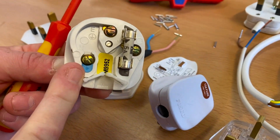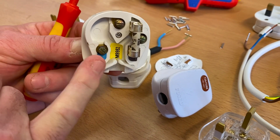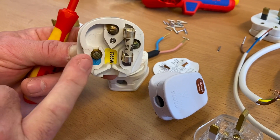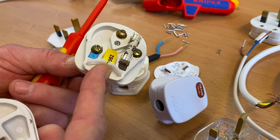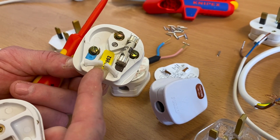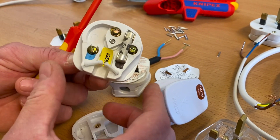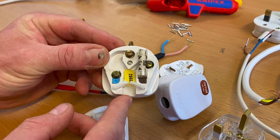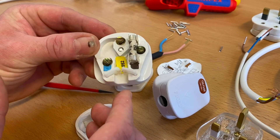Opening this MK plug, you'll see some subtle differences. Instead of a hole into which you screw terminals, you take the screws off and there's a stud or post which you have to wrap your conductors around, then return the screw into place. The cord grip has no screws - you simply push the flex in. This is a more challenging plug top and one of the most difficult things to make off well, especially when building hand-eye coordination.